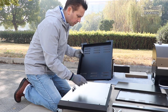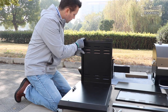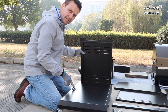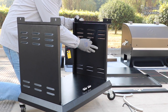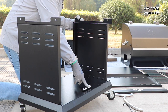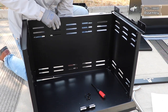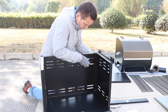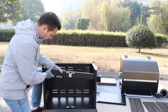The second step is to install the left plate of the body frame onto the platform, with the front of the body plate sticking out on the same side as the magnets. Then secure the right plate the same way, with the protruding part at the same end as the magnets. After securing both side plates, install the back plate using six bolts — two at the bottom and two on each side. Then, with the arrow facing up, secure the beam to the left and right sides of the body frame.